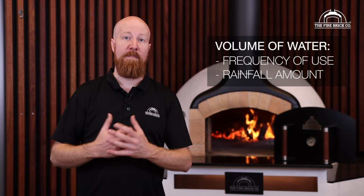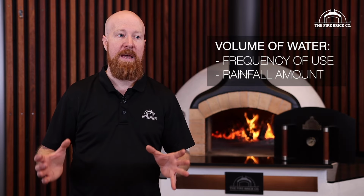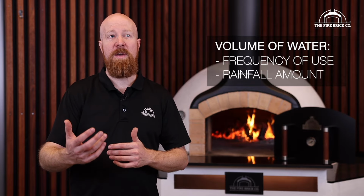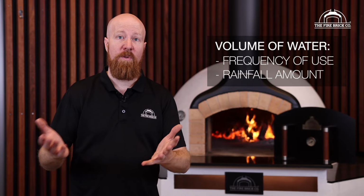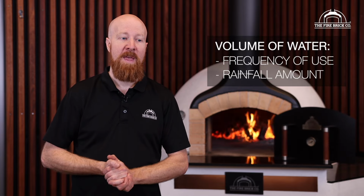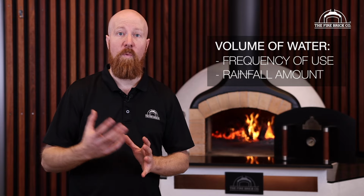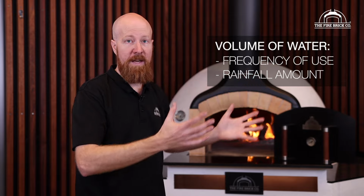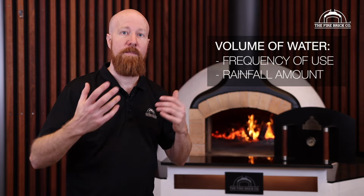If, however, you're more like me, maybe life's a little busy, and as much as you might like to fire the oven twice a week, it's not really practical for you. You may only be using the oven maybe, say, once or twice a month. And maybe, like me, you live in a relatively high rainfall area, so I'm not on the edge of the desert. If that's you, then your oven is actually going to be absorbing a moderate amount of water in between firings. Because let's say a month goes past, it gets rained on 4 or 5 times, that's going to be a moderate amount of water being absorbed by the oven.